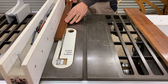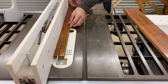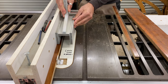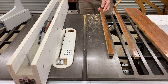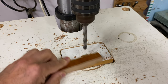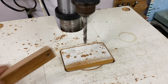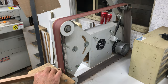I started with the arm struts first, which I ripped from these boards of old reclaimed hardwood. I think it may be oak, but it was very strong and sturdy, so it was perfect because I wanted the struts to be as slimline as possible. I needed six and they ended up at roughly 20mm square. Their length is around 600mm long, but that wasn't critical — I just made sure I had matching pairs. I then drilled an 8mm or 5/16 hole in each end for bolts to go through. I later found out that these holes were too close to the end because that very small piece of timber left between the hole and the end of the strut broke out on a couple of them. So I ended up cutting the struts a little shorter to remove the initial holes and re-drilled them further back from the end.